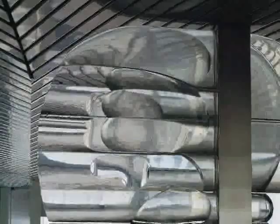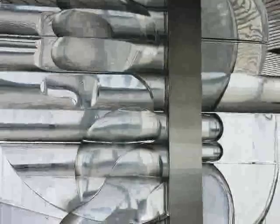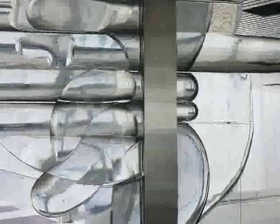I wonder how they got all the curves in the glass so smooth. The surfaces are all cold worked. Hand grinding machines were used to cut away glass and finally to polish the glass. As the grinding and polishing took place, it was essential to keep the work wet and cold. If the work is allowed to become hot, cracks will develop and the work will be destroyed.